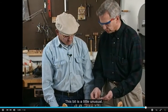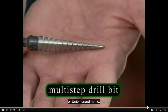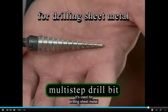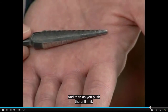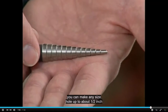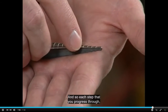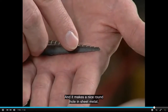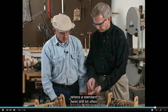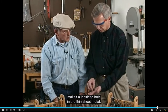This bit is a little unusual. That drill bit, David, is a multi-step drill bit, or unibit — brand name. It's used for drilling sheet metal. You can start by drilling like a one-eighth inch hole, and then as you push the drill in, you can make any size hole up to about a half inch with that particular one. So these are steps, and each step that you progress through you get a larger hole. It makes a nice round hole in sheet metal, where a standard twist drill bit often makes a lopsided hole in thin sheet metal.